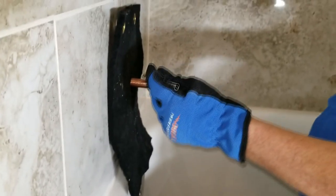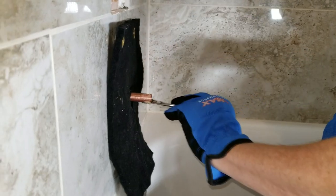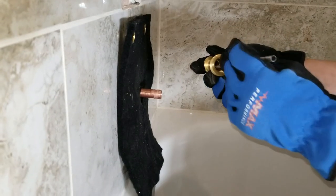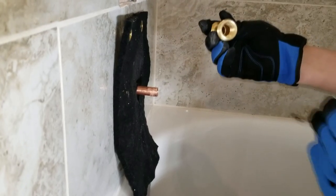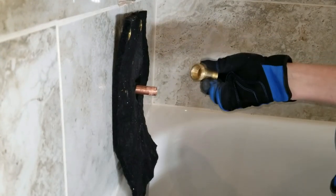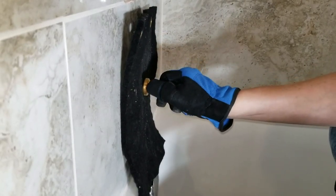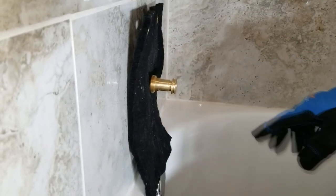So I'm going to put some flux on the pipe, just right around there and around the bottom. Now I'm going to take some flux and stick it in the back end of the adapter too where the pipe will make contact — make sure I've got plenty of flux inside there. Now I'm just going to put the part in place, make sure they're mated up nicely and that it's on there straight. I can see the copper pipe all the way up against the edge here, so this is ready to solder. I'm going to stick the solder into the front there as I heat it up.